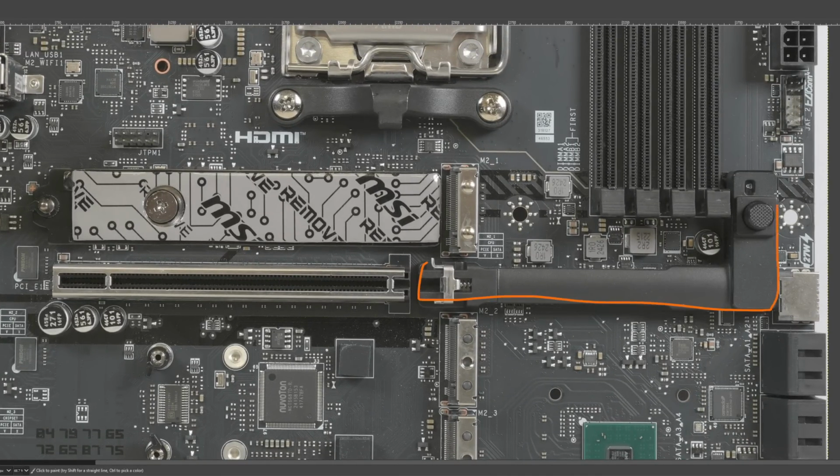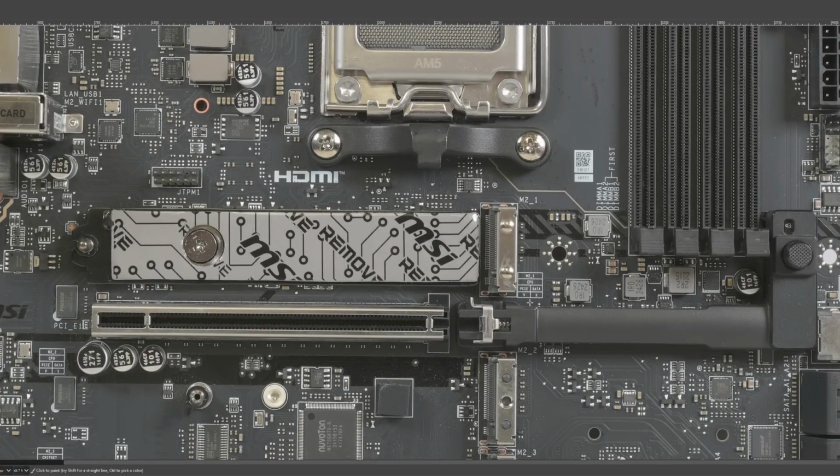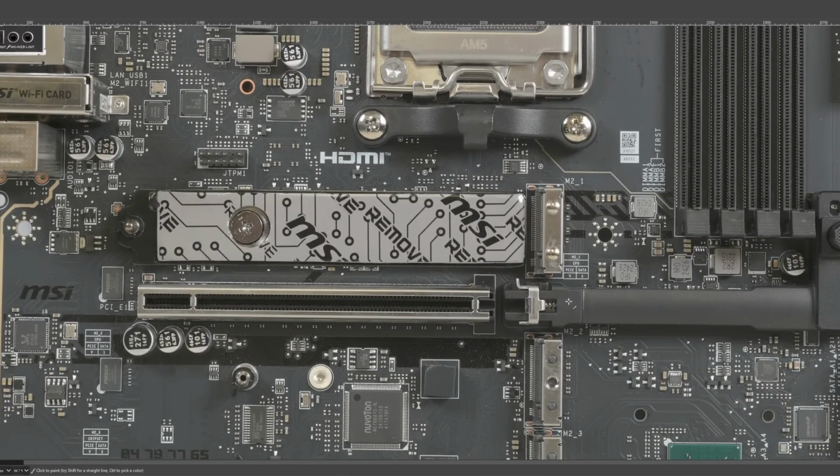And then you do get this quick release mechanism. And this one, I really like, because basically you push the button and it locks the card, and then you push the button again and it unlocks the card. So you don't have to press and hold while pulling the GPU out. It's a toggle latch, which I really like. Because that's just way more convenient, because you can just unlatch it and then pull the card out with both hands, instead of awkwardly using one hand to press the button and the other hand to pull the card out. So I think this is really cool.